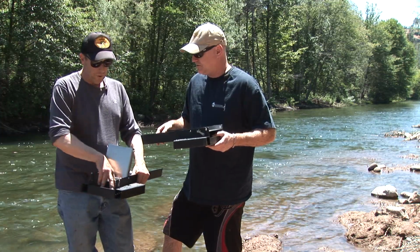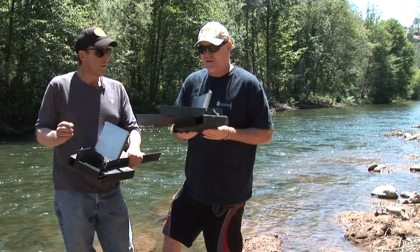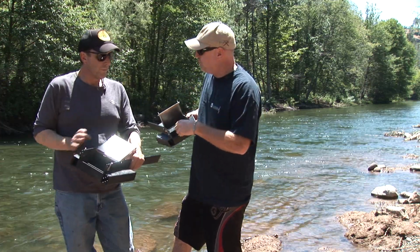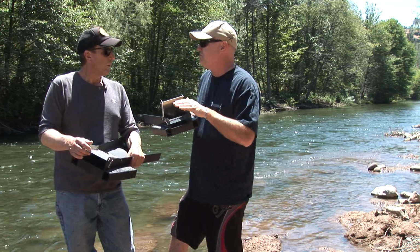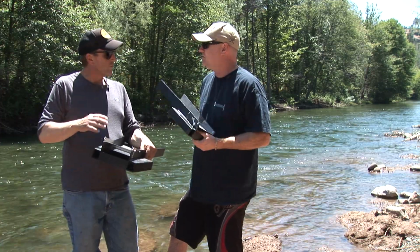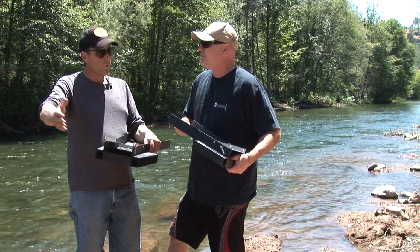So basically it fills this box in here, and the lights just get pushed out the other end. Okay, and so water goes in through here, and it tapers down, causing water pressure to escape through these holes and creating a turbulence inside the trap, which is enough turbulence to cause the gold to stay in and the lighter material to go out. Right, all the material that goes in the box gets washed by that flow. Okay. And what happens is it flattens out, the heavies drop, and the lights just get pushed out.